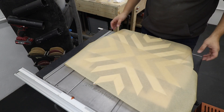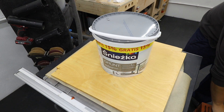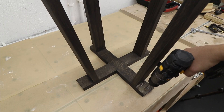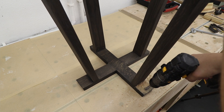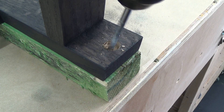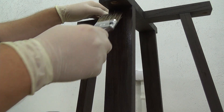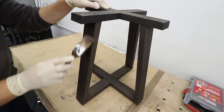Since it would be very hard to clamp each individual piece to the board, I'm just going to put some weight on top to ensure a nice glue-up. For attaching the legs, I'm using a 15mm forstner bit to create a larger hole into which I'll later put a screw and a washer. The hole pre-drilled for the screw is slightly larger than the screw itself, just to give it a bit of space. At this stage I'm also adding a clear gloss varnish finish to the legs — two coats with a light sand in between.